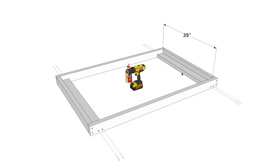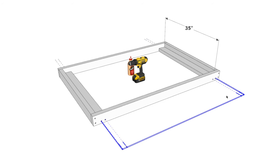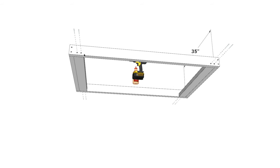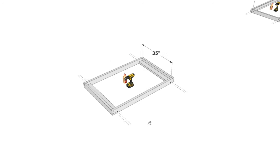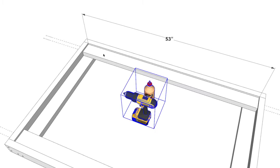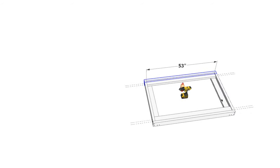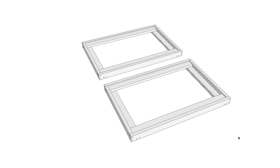Next, take two additional 35-inch 2x4s. These are going to be perpendicular to the original 35-inch 2x4s. Secure with 3.5-inch screws, pre-drill, and use wood glue. These are flush with the other 35-inch 2x4s and are going to be added to the longer side of the side frames. Secure with 3.5-inch screws and wood glue, flushed on both sides. Go ahead and create two of these panels — these are going to be our side panels for the doghouse.